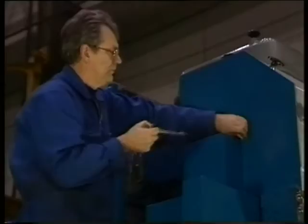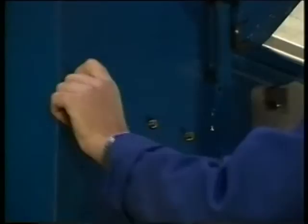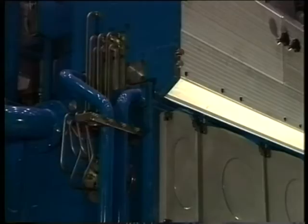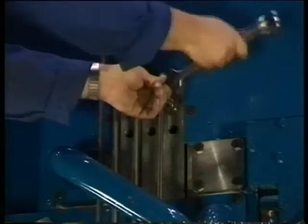In order to slide the camshaft, the starting air distributor needs to be removed. First take away the protecting plates at the vibration damper side. Behind this you will find the starting air distributor. Then remove all pilot air lines and the air supply line. Mark them in respect to each other to avoid mistakes during mounting, and keep the pipes clean.